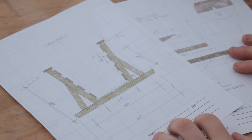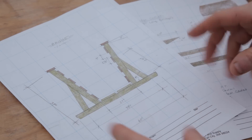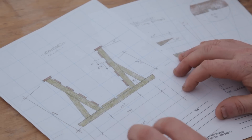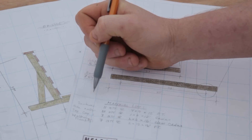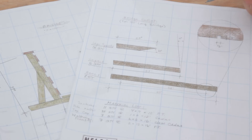I've already gone ahead and drawn up our stanchion and it's pretty simple. You've got one board on the bottom that sits on the cables — that's the only point where we have direct contact with our cable. Otherwise you've got a couple uprights just holding the railing, some side rails to make sure no one falls off, a top cap, and a couple planks. The cut list shows all the different pieces: our bottom piece is five feet with two channels cut out four feet apart, our main uprights are 39 inches long.